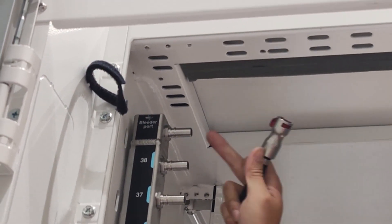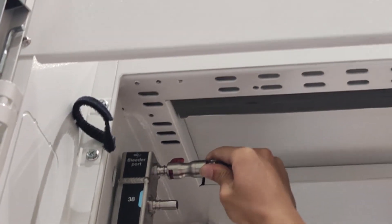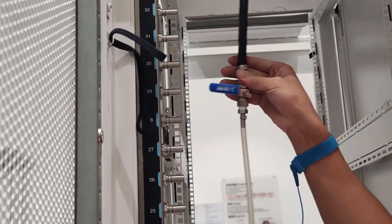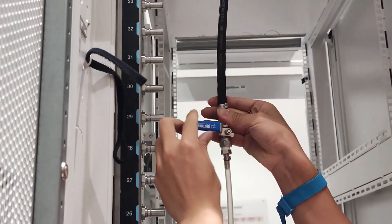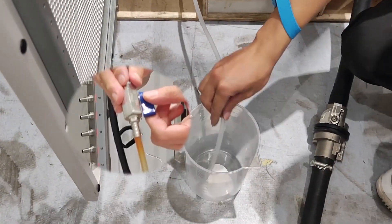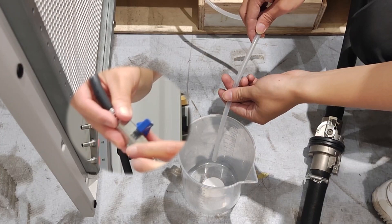To make sure that there is as little air inside as possible, reinstall the bleeder kit back onto the manifold supply side and then push the air out of the manifold one more time. Close the bleeder valve when a steady stream of water is flowing into the bucket or there are only minimal bubbles in the bleeder hose.